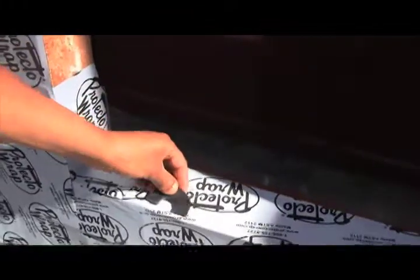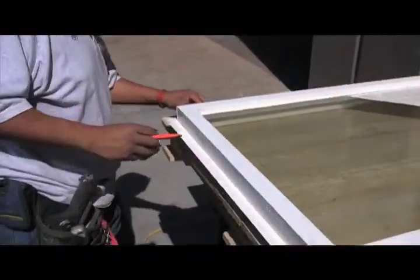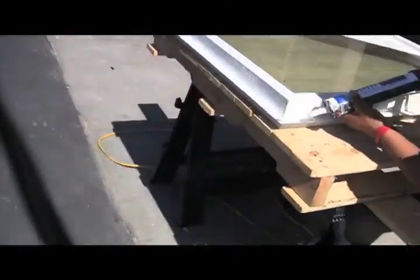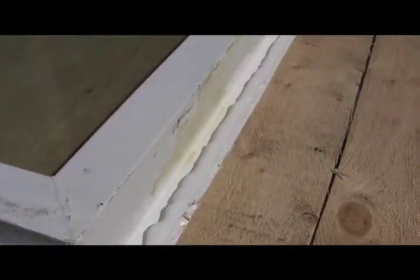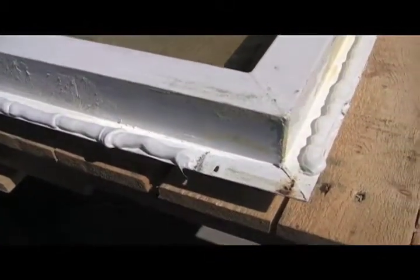This is a horseshoe shim that we've snipped so that it will fit nicely underneath the window. What Epi is doing is marking a position three inches on the right and left of the lower nail fin — these will be areas where we will not apply sealant. Now we're using a high quality polyurethane sealant. We're going to put a nice plump bead of sealant toward the outboard edge of the nail fin to ensure that we have squeeze out around all points on the window. Notice the gaps in the sealant in the lower right and left. When your sealant is correctly applied, you'll see squeeze out that should look just like this.